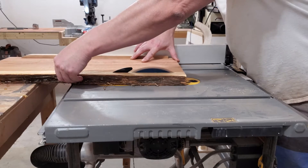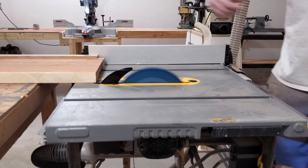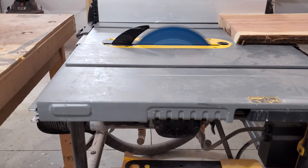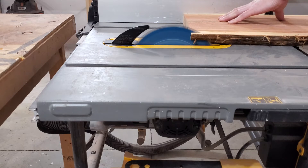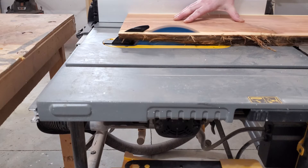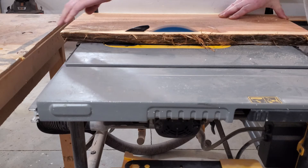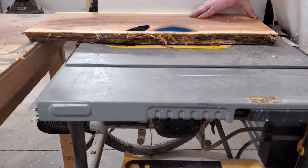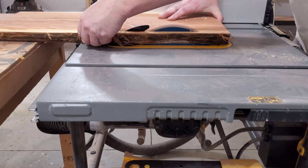It was important that I removed only as much material as I had to — basically just to remove the bark and square the piece up. The leg itself will be the tenon, so I wanted to work with a somewhat square piece when removing material for the mortise. I also wanted a symmetrical look — the same amount of sapwood left on each leg.